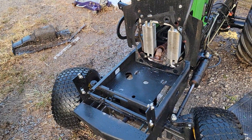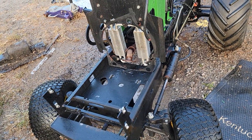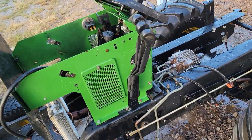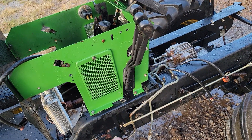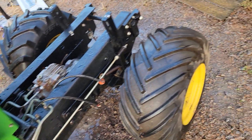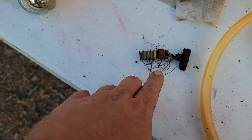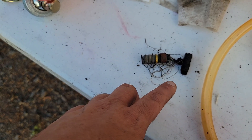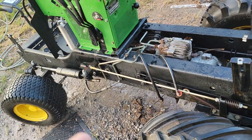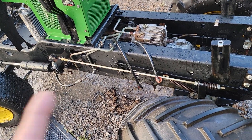I've got it all stripped down and pressure washed. I'll let it sit out here tonight, let it drip dry, and let the sun hit it tomorrow. I've already done one order with John Deere for some filters and some fuel tank grommets and stuff like that. The pickups are extremely rough, so I don't know what I'm going to do about that. I may just do a regular hose and drop it down in there, because I will have a pre-filter and obviously the electric pump from the Kubota.